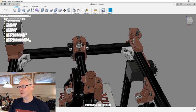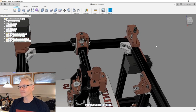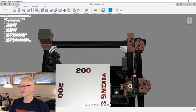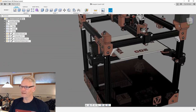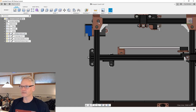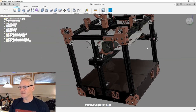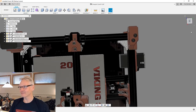We need to make sure that our cable loom is not restricting any belt paths or any travel movements. So that's always a challenge. And also, we did not want it to go far beyond on the outside. I don't want it to build huge on the back here. If we call this the back where the extruder is, we could build outside at least the same amount as the extruder. But remember, we also are going to keep our filament roll hanging on the back extrusion here, so there's not so much space. And we also need it to be pretty, and pretty and convenient are not always matching together.